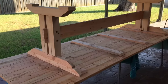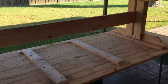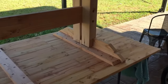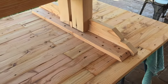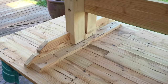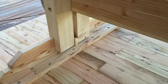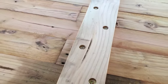With the table and the base now upside down, I was able to get the cross braces in place where I wanted them. The two end cross braces are positioned so that they butt up against the inside of the table base, keeping the base centered along the length of the table and also stopping the table sliding on the base, because the table is not going to be permanently attached to the base. The cross braces also allow for expansion across the width of the table.